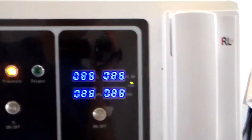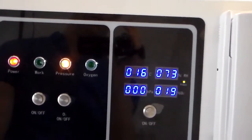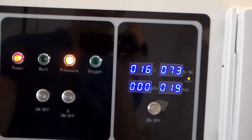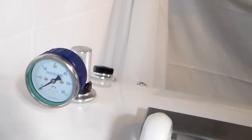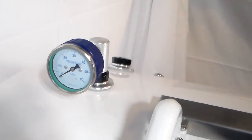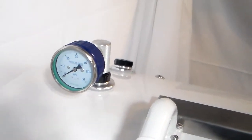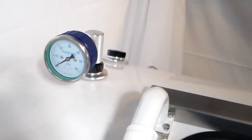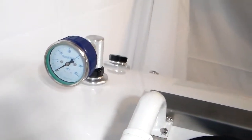We're going to turn the display back on. Once the unit reaches about 52 kPa, which is shown here and also on the pressure gauge, the release valves in the rear of the chamber will open and you'll hear that. The release valves will stay open and continue to let air out of the chamber as long as you're at 52 kPa. The unit will never go higher than 52 kPa.